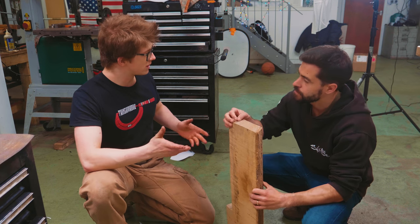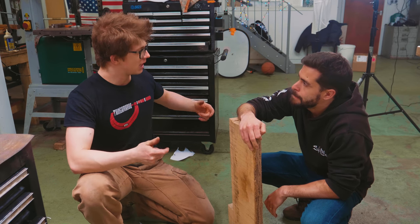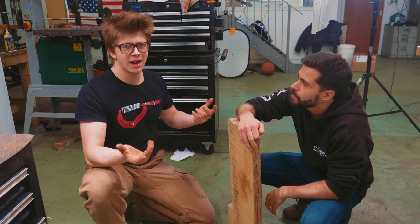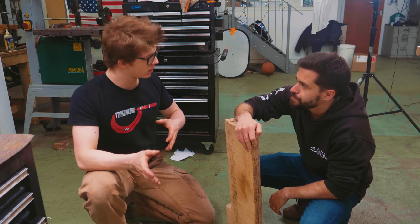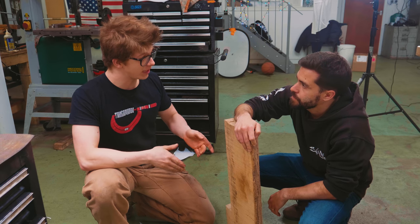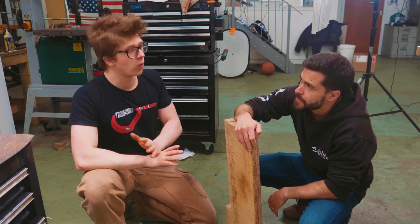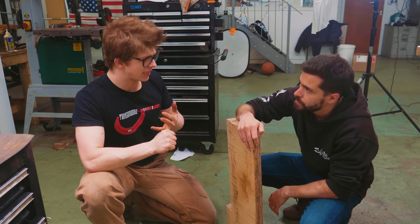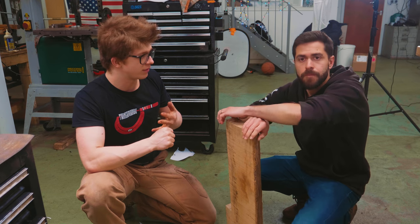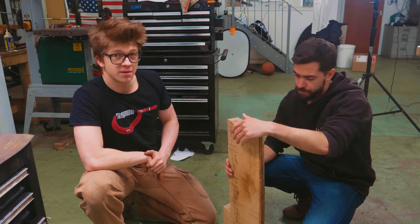And so what I would do is I'd get the hickory, cut into this rough handle shape, and then I'd be able to sort out, like, half of them weren't good enough to use for handles, sort out the good ones from the bad ones, and that way I was able to get hickory here, because I certainly found with hammers, if I could do hickory, I wanted to do hickory. Because that little bit of extra hardness, a little extra strength that the hickory gives was really beneficial. Here for the axe, hickory is all we've got, but it's gonna be just fine.